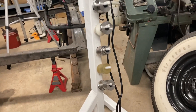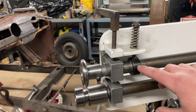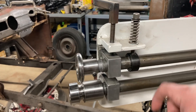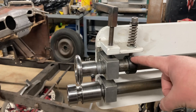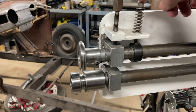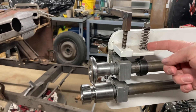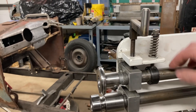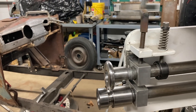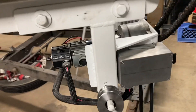On the front side of the frame we have a few pins in line to store some of the extra dies. I added a collar on the top shaft — just a simple collar for a one-inch shaft. The set screw is 5/16-24, so I threw in a stainless bolt about three and a half inches long with a cupped washer and a spring. This assists in automatically removing the top die just by turning the crank, so I can remove the material after forming.